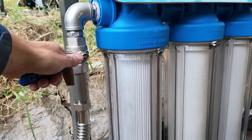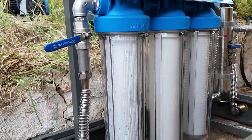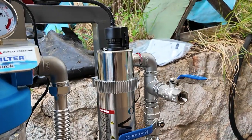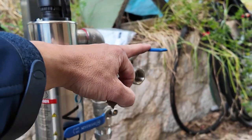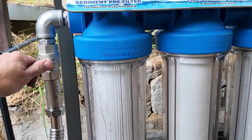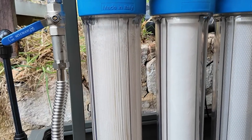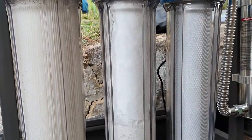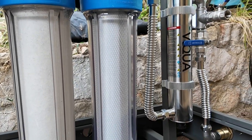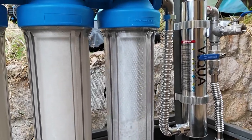Now what we're going to do is open the inlet and let the water come in slowly. If it comes in too fast it can wash a lot of mud in because it suddenly comes gushing in. There is a bit of crap in the water - it's a little bit tannin, the tank's fairly low, so I'll let that fill slowly. What it's doing is it's coming out through the flush tap - this tap is designed to flush and purge air out of the unit. I'll leave the one going to the house isolated for now, just so we get all the air out of the unit. So that's filling up - we'll just give it a little bit more pressure. So there's those clear filter housings in action - really cool. That's filling stage one, the pleated cartridge - now it's filling the spun cartridge, and now the carbon block cartridge will be filled up and the UV chamber. Normally you'd run this unit for five or ten minutes to purge out all the air and give it its first flush.